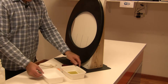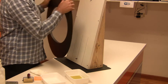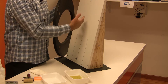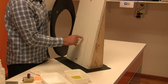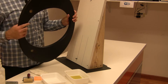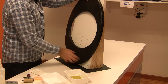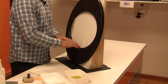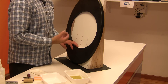I'm going to show you the fixture we made that holds the part. Basically we have a piece of melamine — it could be plastic, melamine, or some other material with a protective coating so that the liquids don't soak in. You can see a center line and two outer lines; the two outer lines are what we're going to align the corners of the transfer up with. We've got a couple of pins that correspond to holes in the front and back of the part. To position the part correctly, we simply put the pin in the top hole and lock it into the bottom hole, then press firmly against the fixture so that the back plate becomes the fence we use to center the transfer on the thickness of the part.